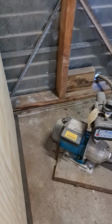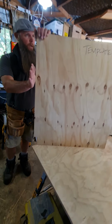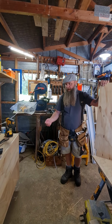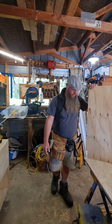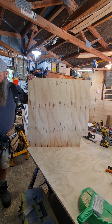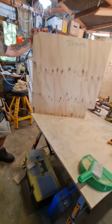So this little notch allows for that, so that I can get the back of the cabinet, which has a solid piece of plywood screwed to it, that pushes tight up to the framing, which helps with thermal break and also makes it a bit more difficult for the little ratties. This bit at the front, this notch out here, you have it in every bloody kitchen. It's just a cool toe space so you can get your feet in a bit closer to the bench.